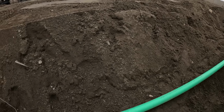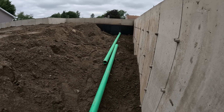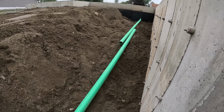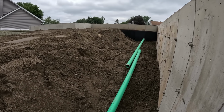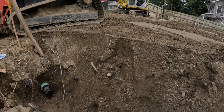We'll put this. Obviously, you see there's enough pitch. Got another piece in the van to make it. I'm about 5 foot short. And then we'll pad it. This was all compacted with the 88. And then Monday, we'll just throw a bunch of dirt on her after inspection.